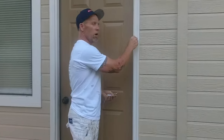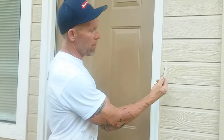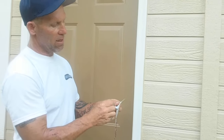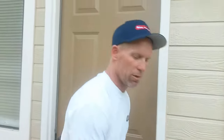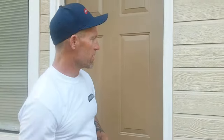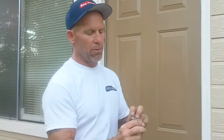To begin testing, you can rub the swab right on the surface and test for lead there. But if you're going to be doing any type of sanding or scraping, it's very important to know whether what's beneath the surface also has lead. You can scrape a paint sample off a house and test the back of it too — not only the surface, but also what's underneath. On older pre-1972 to 1974 homes, you could have multiple coats of paint and the top layer may not test positive, but what's underneath would be lead positive.